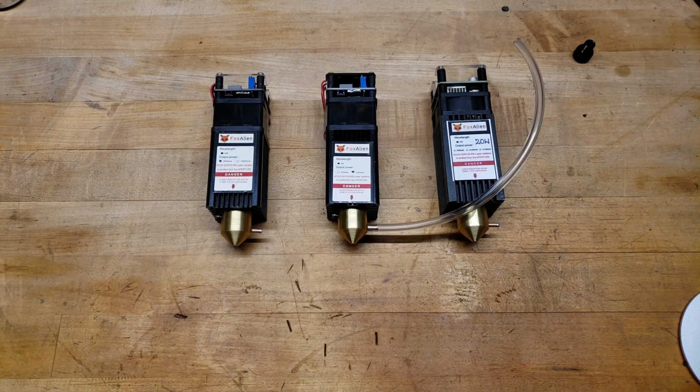And when that laser beam is hitting your wood piece, for example, once that spot vaporizes, it consumes the oxygen around it, and it starves the next layer below of the oxygen needed for this conversion process, this burning. Air Assist is always blowing, and it's acting as that bellows, and I feel that's how it helps even make that flame burn hotter.